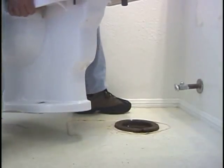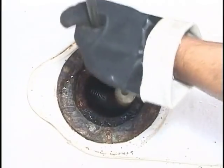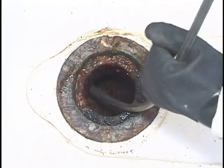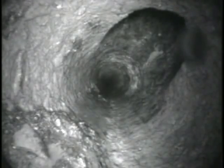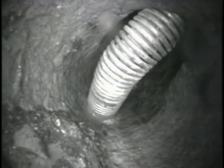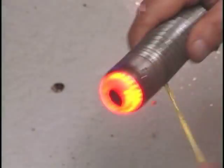Getting into the line from a removed toilet fixture can sometimes be tricky. The pipe we're entering here is an old cast iron pipe with several years worth of buildup. We're able to make it through the T connection with some difficulty, but there's a combi immediately after. Because there are several tight turns in a short section of pipe, we can't build up enough momentum to pop the camera through with a quick push. The camera simply won't go through the fitting from this access point. Here's another place where a piece of string looped through the spring can help get the camera pointed through the fitting.